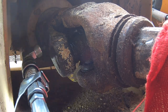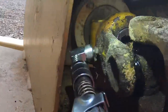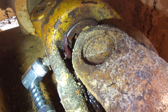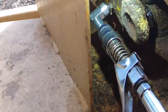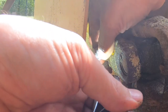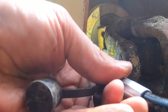Grease is coming out around the PTO shaft — you can see it there. So the Lock and Lube 90-degree did a fantastic job. To get that off, you can't just pull it — you need to loosen that knurl and then it slides right off. With it loosened up, it slides right off — pretty nifty.